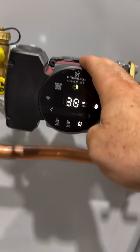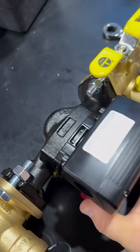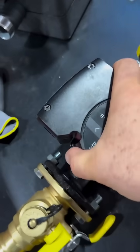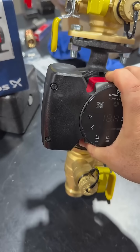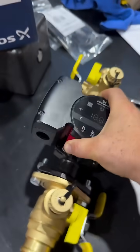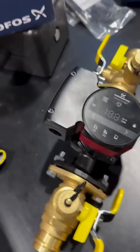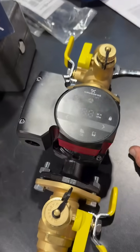Physically, for size it's the same as your regular small circulators. Flange connection — you can get multi-flange on these too. Really cool: if you've got circulators next to each other and need to get it into a tight spot next to a boiler or a wall, you don't have to turn the unit at an angle to reach the electrical, because the screws are right here on the front — this whole panel pulls off and you've got your wiring right there. Just some high-level stuff on what the Grundfos Alpha has in store.